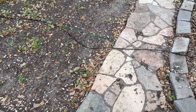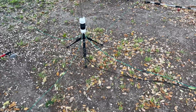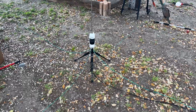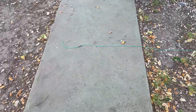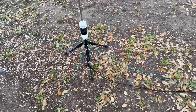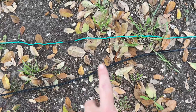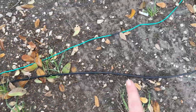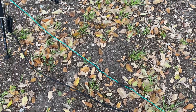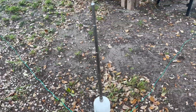361 Corpus Christi, Texas here. We are outside — it's not fully done right now because I don't have enough wire to do the radials. So we got the wires out, got four radials, not sure how long they are, but I had to attach links to it — attach one right there, attach one right there — and we're still up at 13 SWR, so I gotta go way longer on radials.